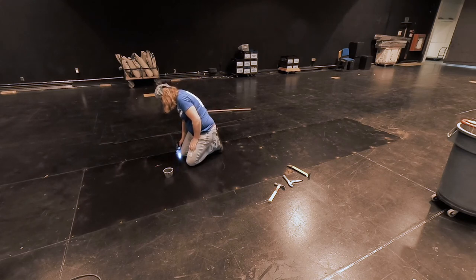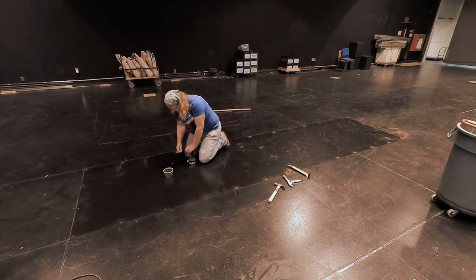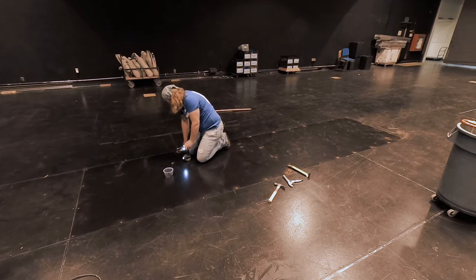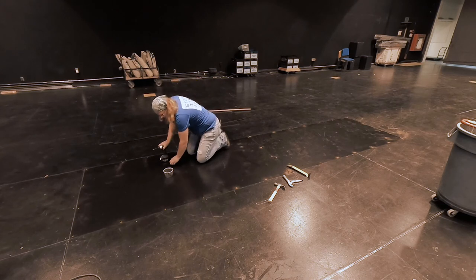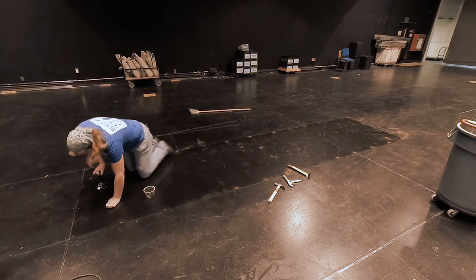What you will do with a theater as old as this one, with as many layers of masonite all been placed down, if we were to re-masonite the whole thing, we might want to offset them so they go on in a different pattern to avoid that problem. And you'll also experience frequently, just randomly, and it happens all too often, where I screw a piece of masonite down and I hit the head of the screw in the plywood lid, and you just would think the chances of that are none or virtually none, but they happen quite frequently.